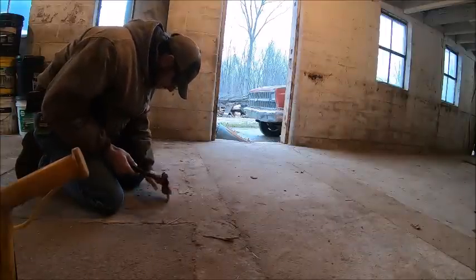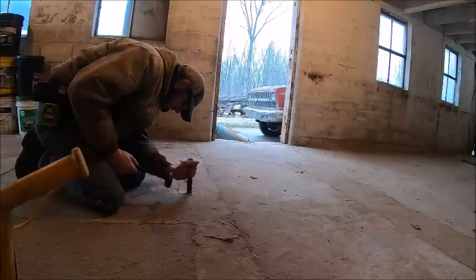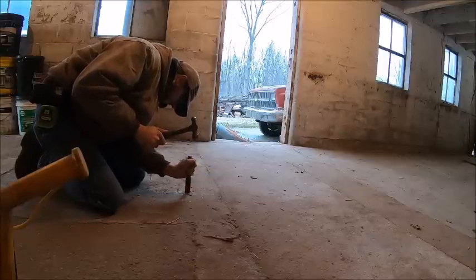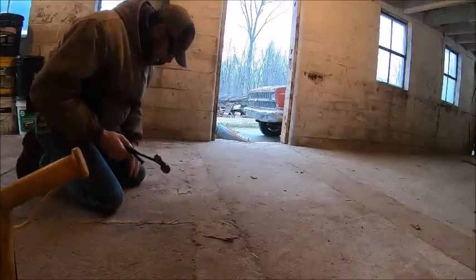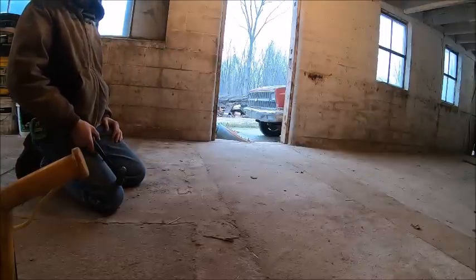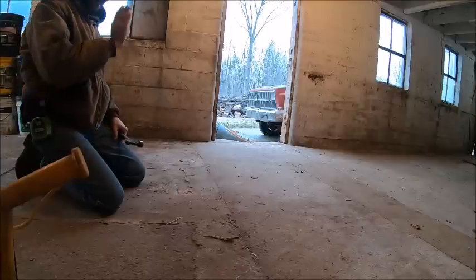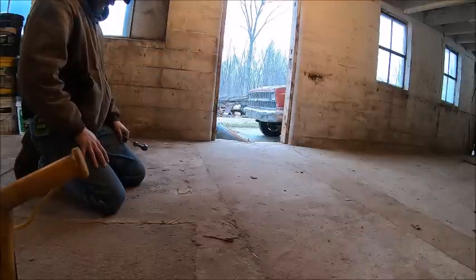But my main goal in doing this is just to give me a corner mark that can't be lost, that can't be washed away by water or anything like that while I'm cutting. The interesting thing is going to be keeping a line straight for that far, because unfortunately that saw does not have a guide. What I might end up doing before I actually plunge in and make the cut is just take the saw and make a scratch mark across there.